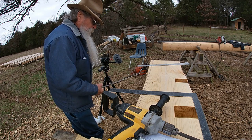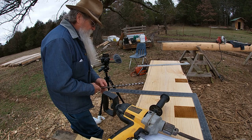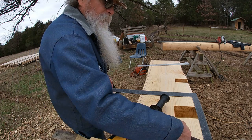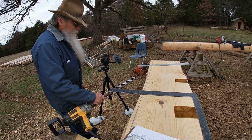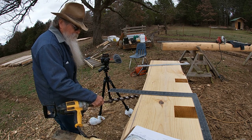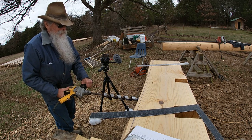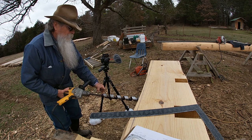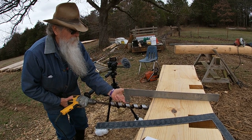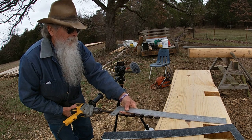I've changed my bit — I was using a three-quarter inch ship auger bit to drill the anchor rod holes. The anchor rods are actually half-inch, but I wanted just a little slack around that rod for adjustment when setting the sill logs down over them. I've now switched to an inch-and-a-half ship auger. I'll do the same thing — drilling straight from one side then going around to the other. I have an old square with the short leg cut off that I can lay right on top of the drill bit and slide it out to sight alignment.